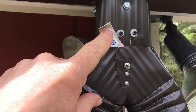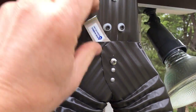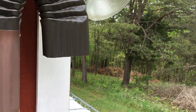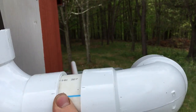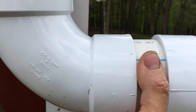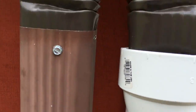It's a lever — not really a switch. In this position the water comes down this side; pull it out and move it over and it comes down the other side. Right now I'll let it run its normal side. I miscalculated over here — my initial plan was to use two 90-degree elbows to come down and out, but I'm a good foot off and there's only an inch to an inch and a half of clearance, which is going to cause an issue.